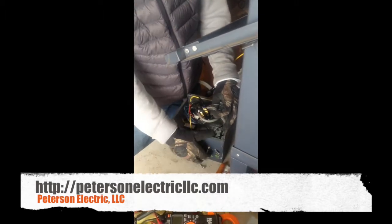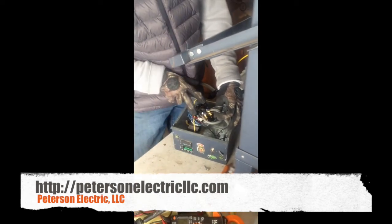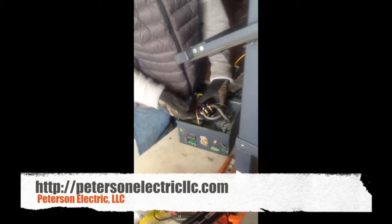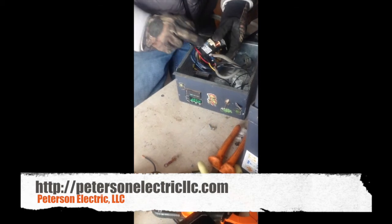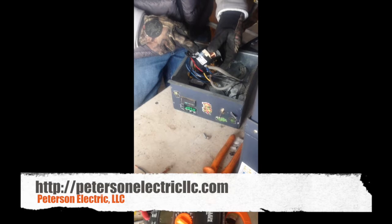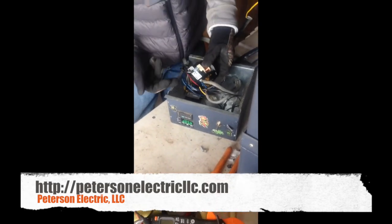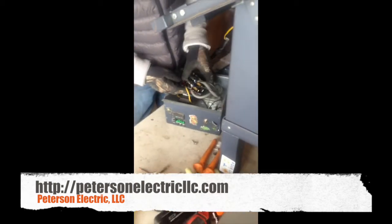The snap switch right here is rated at 8 amps, which is fine because all we're switching is a thermostat and a coil — I guarantee both are rated at less than a quarter amp. On the contactor itself it says 240-volt rated, or 208 on the coil. The contactor is rated at 30 amps, has a model number, serial number, and it's made by Square D.